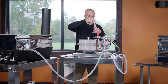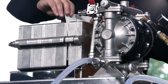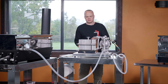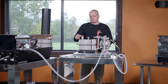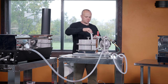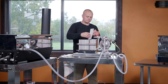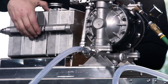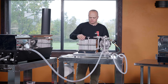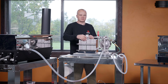I'm going to load the papers in — the holes need to be down. Another advantage of the Smoky Lake stainless steel filter press is that it is a tilt-free unit. Some units require you to tilt the filter press bank up vertically, take the plates off, and then stack a paper, drop a plate, stack a paper, drop a plate. With the Smoky Lake stainless press, all we're doing is dropping a paper in and sliding the plate down. The unit we're using today holds 10 papers and from my personal experience has a capacity of about 30 gallons of dirty syrup before having to break it down, replace filters, and recharge the DE.